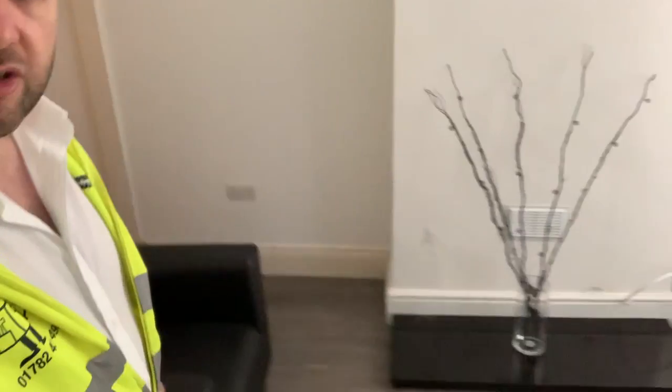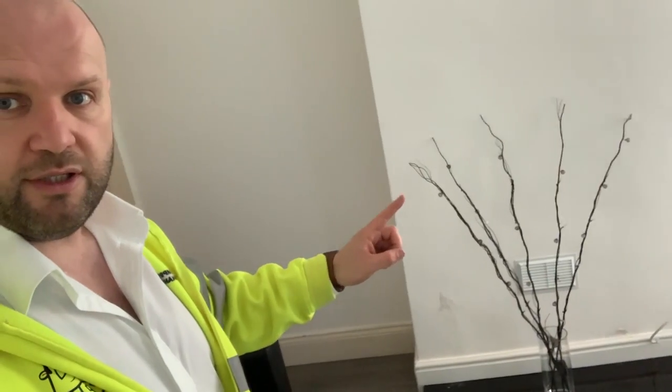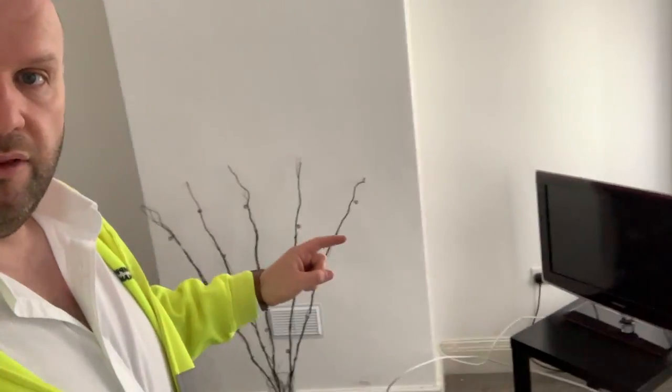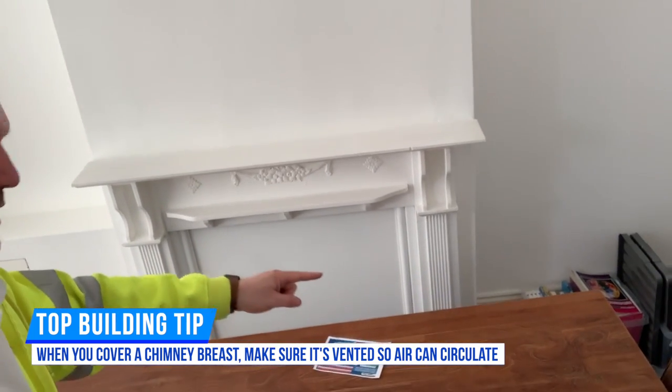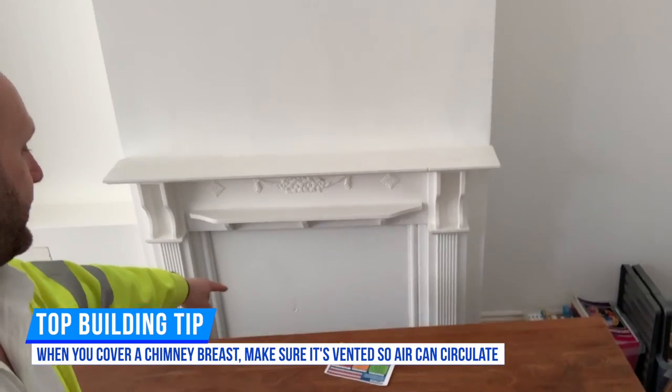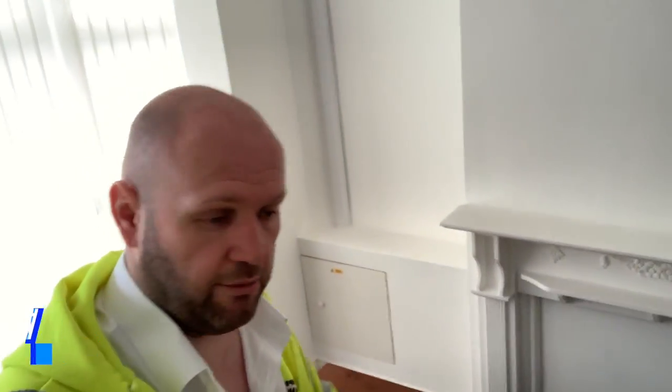So just a quick recap: we've got signs of damp here. Using the damp meter, from this point to there is nice and dry, there's a little bit of damp close to the chimney, and then as it goes off you can see it drying out. So obviously it's just the chimney breast that's wet. We've done the same in the other room. However, we can't test the front because someone's screwed a piece of timber to it. As a tip: if you're going to blank off the chimney breast like that, you should have holes in there to allow the chimney to breathe.